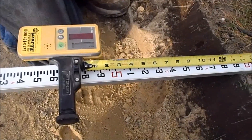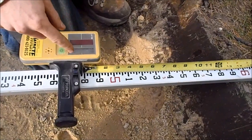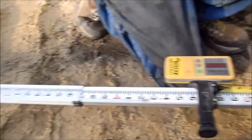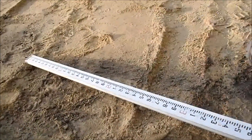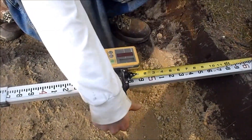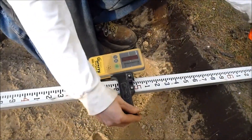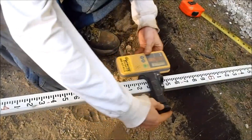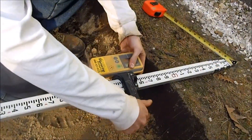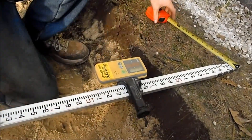I know I have to go down 9 inches. You have to think — it's counterintuitive — because you're thinking about the bottom, moving the bottom of the stick. So you actually have to move your receiver up 9 inches, right up to here. Because that pushes the bottom of the stick down. You have to do the opposite of what you're thinking. It's a little confusing at first.